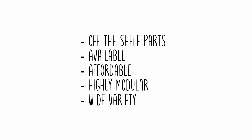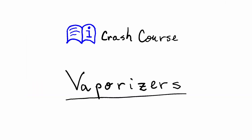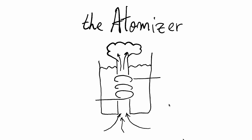That being said, I can't be ungrateful to the vaping community for the wide range and availability of small fog machines. I climbed the learning curve the hard way, so here's a quick sped-up crash course in vaporizers. The atomizer is the ensemble of a heating element — which can be a mesh or coil — combined with some sort of wick, placed inside a small tank that gets filled with the juice, a glycerine-based solution.